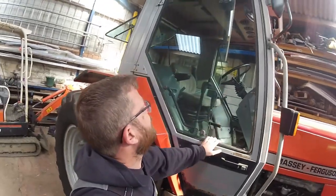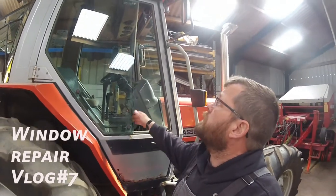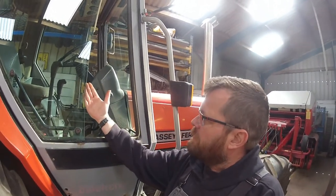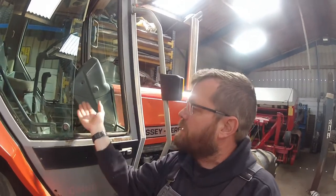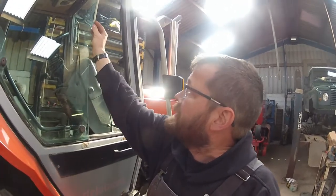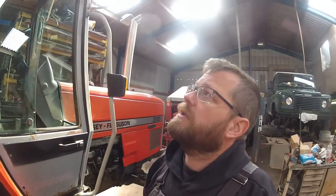Today I'm on with this job. I've had a look at it and thought about taking the door off, but actually I'm going to take these four bolts off and take the glass off, and lay it flat. I decided this would be better than vertical so I haven't got gravity fighting against me pulling the silicone down. I'll put something behind to stop the silicone dropping through, try and set that bead of silicone between the two, let it dry, and hopefully it works.